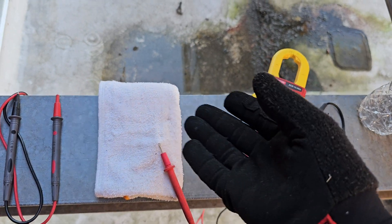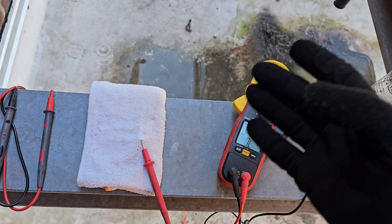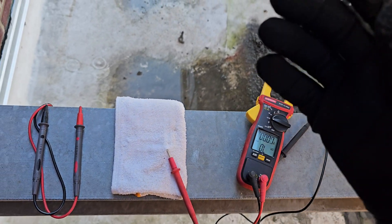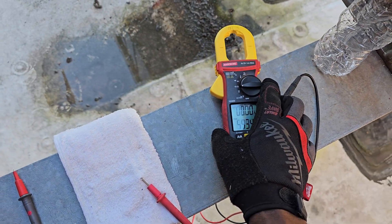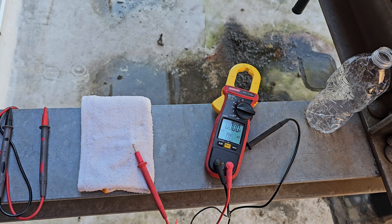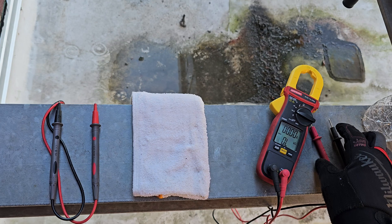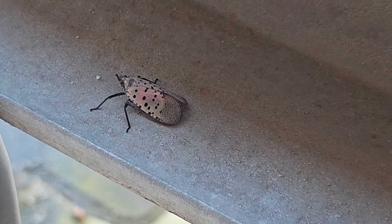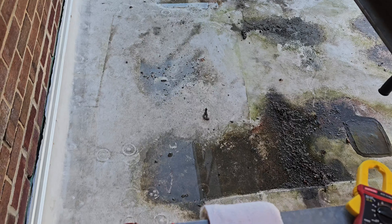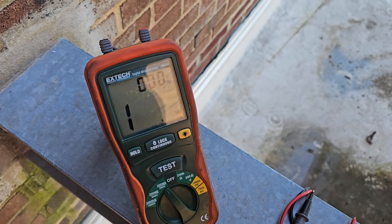If you were checking a load — a compressor or a motor — we do HVAC. We're testing a motor to ground, or a compressor winding to ground, or your incoming power wires to ground, and you're seeing this high resistance. You go to continuity and you're getting open circuit — OL. And you're getting this higher resistance reading and you'll think: why is my breaker tripping? Why is my fuse blowing? This resistance is very high. So let's see how the resistance reading of this meter stacks up against the megohmmeter.